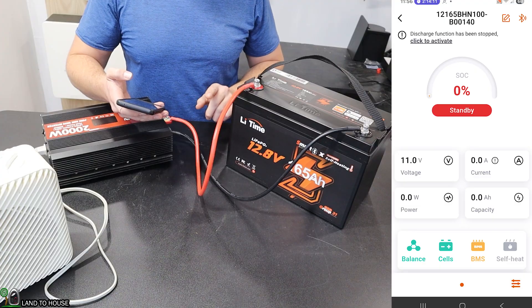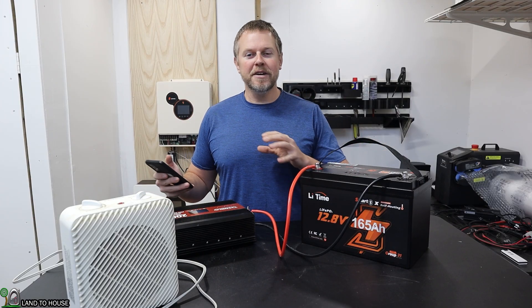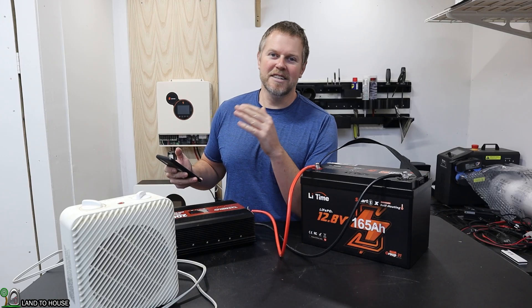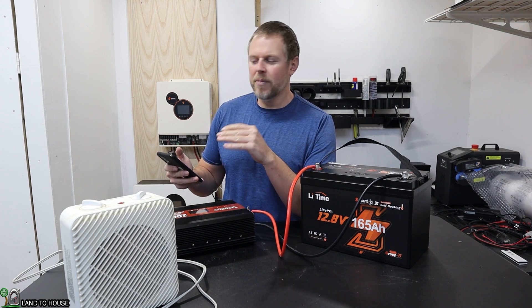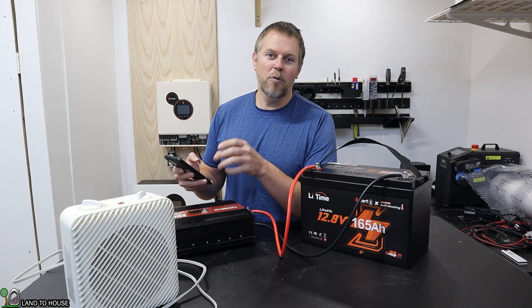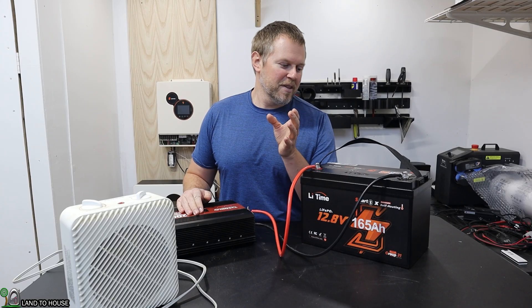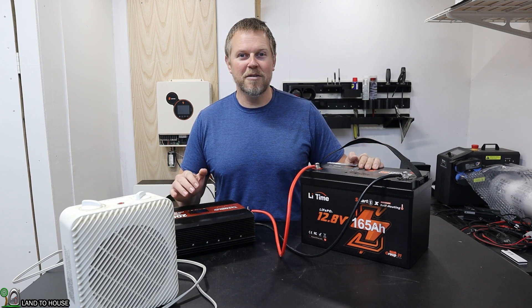Keep in mind that when the battery drops too low, the app will stop responding. This battery is rated at 2,112 watt hours. We ran it for two hours and 13 minutes — that's 133 minutes — at 965 watts of draw, divided by 60, gives us 2,139 watt hours. The variation in power draw accounts for the difference from the rated 2,112 watt hours. So this thing has at least performed at spec, probably even better than that, which is pretty awesome.